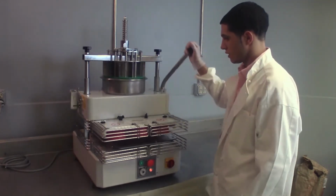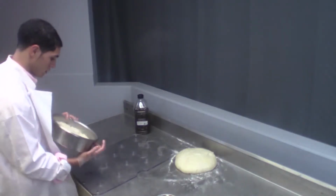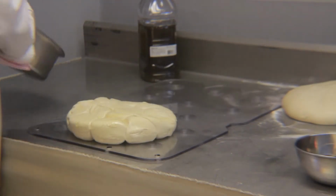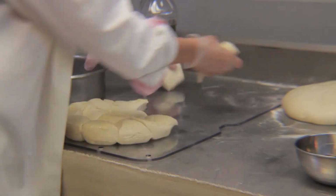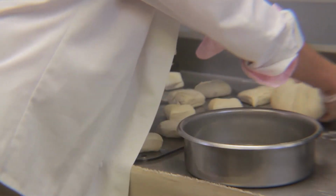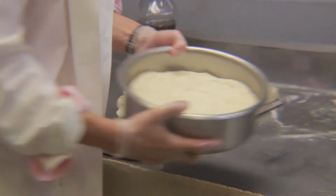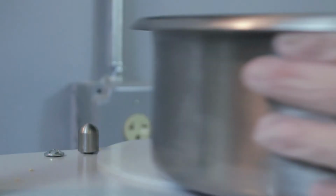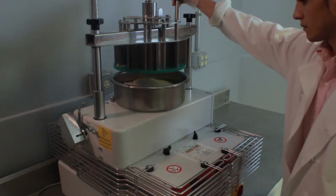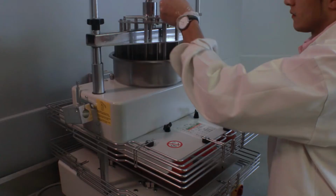To release the pan, push slightly forward on the lifting lever with your right hand, disengage the handle lock lever with your left hand, and raise the lifting lever up. Remove the pan from the machine and place your cut dough portions into the receptacles on the dough tray. Place another uncut dough portion into the stainless pan and press the dough down to ensure that it will be cut evenly. Insert the filled pan underneath the divider head and align it with the dowel pin stops. Cut the dough by pulling down on the lifting lever with your right hand and disengaging the divider release lever with your left hand.